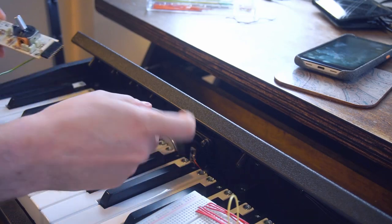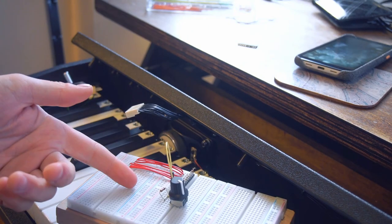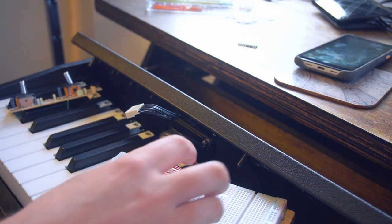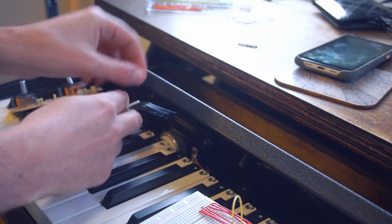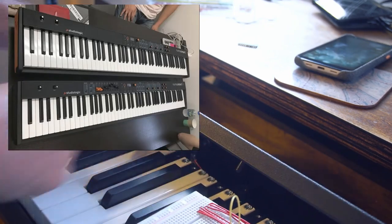Obviously we can just connect on this end and then on this end with some headers. This is so small. Normally I would like to have a little PCB to anchor it, but this is only three components, and then we'll add a switch, so that's four components. I think I might just try and do point-to-point wiring. I think what we should do is locate it a little bit over here. There's some room on the front panel. This is where the faders go on the upgraded version.